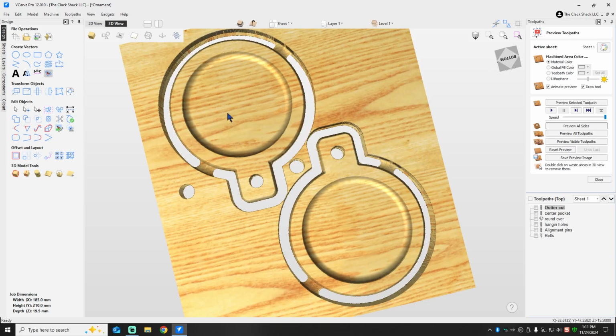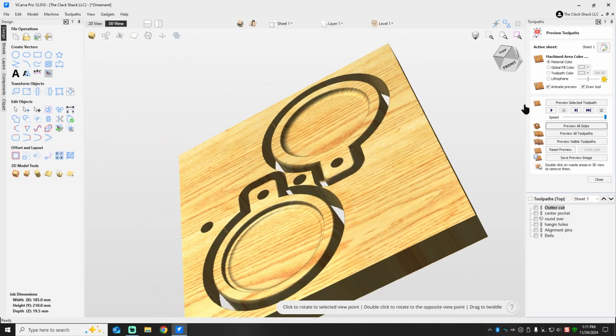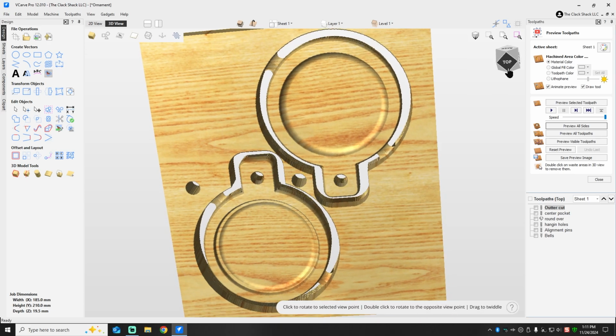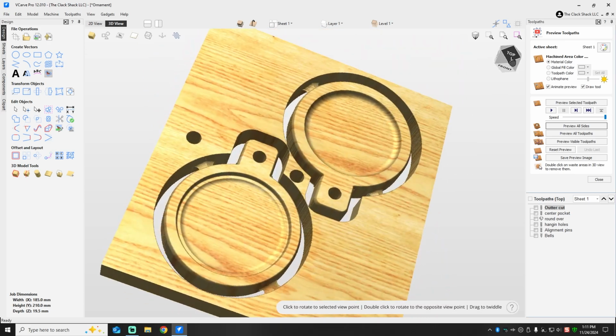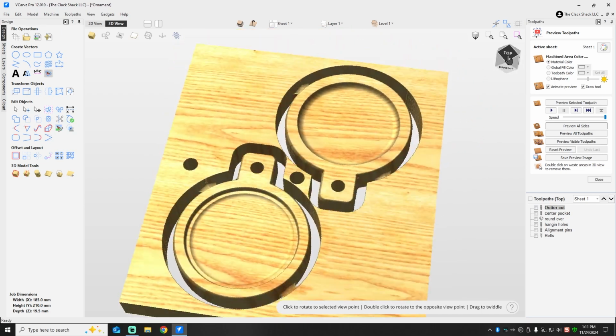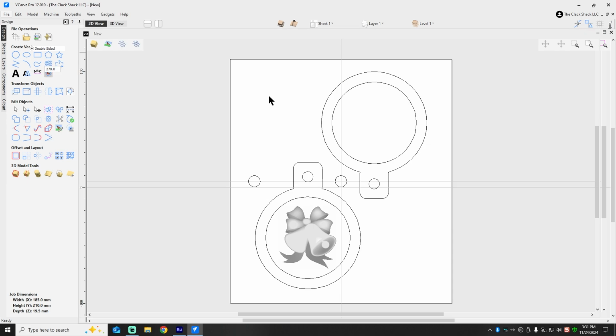And you'll see that I've got it set to where these things can dish. I am leaving tabs here and here. The way I've got it worked out, I'm leaving 4 millimeters of tab on each side when I do the cut, so they'll wind up with an 8 millimeter thick tab, or thereabouts, from this little peak. So I end up with 2 tabs holding it in place just towards the end. But I'm also using tape, so there's also tape back there holding it. And so far, I've cut out 2 sheets of these with success and no material coming loose. So there you go.